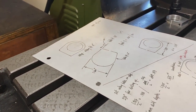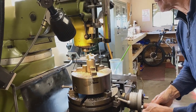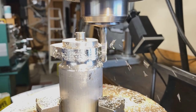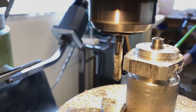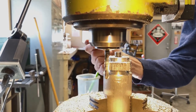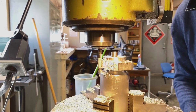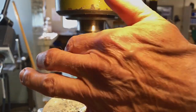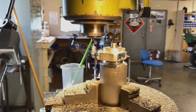I'm going to start at 170. I'm doing the final cut now, and you'll notice that the end mill is going the other way — it's called climb milling and it makes a smoother finish. The last operation is to face off the end, so I'll set the rotary table at zero degrees and then bring the mill around and face it off.